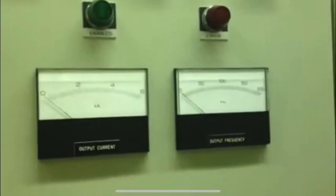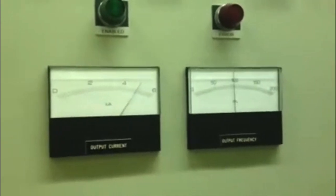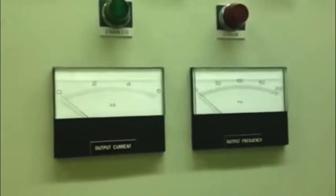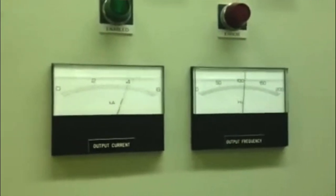So we do that, and we make this giant AC wave that's firing down all these motors the entire length of the train. But it's doing it through all 6 coils, through both sets of stators, the entire length of the train, and it's doing it, let's see, what would that be? 60 hertz is wall voltage, typically what we use. So we're doing that at 120 hertz. That means we're sending that pulse to accelerate down that train 120 times per second at roughly 5,000 amps to drive that train forward. And I say, whoa, that is a lot. It's like, absolutely, that is a ton.